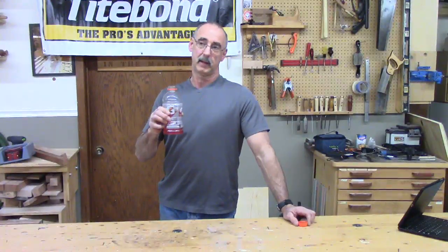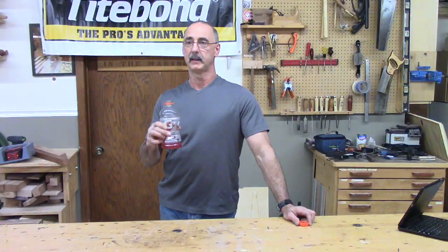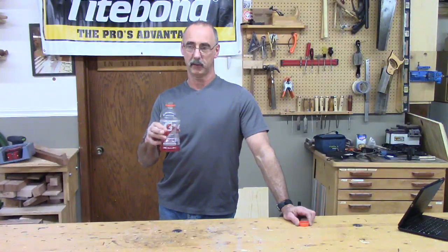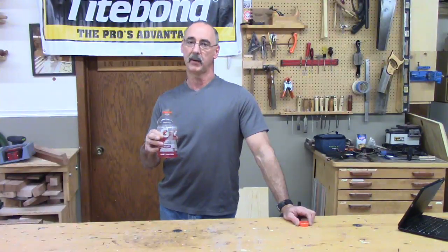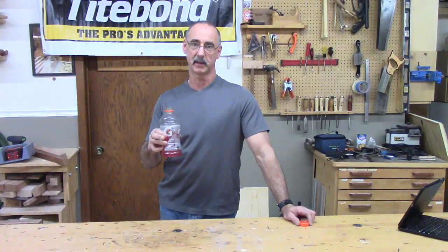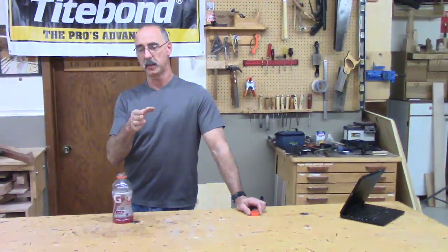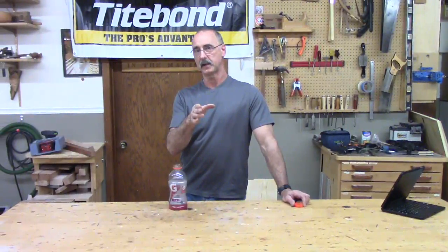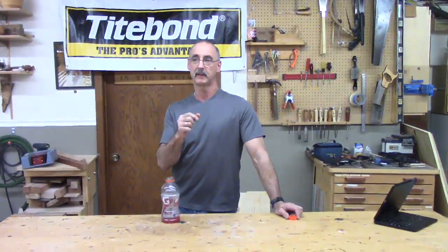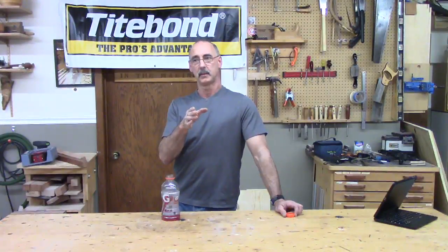So I've got a Laguna bandsaw with a Timberwolf blade on it, and generally I'll check for drift. Probably 9 times out of 10 I don't have to do any drift compensation in the fence. I can just go ahead and make the cut. What concerns me the most about this is when you say the blade seems to deflect under cutting pressure. I think you don't have enough tension on the blade. You have tension deficit, which is a bad problem.